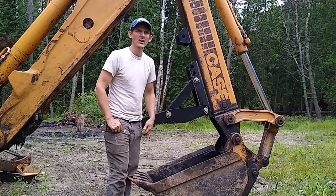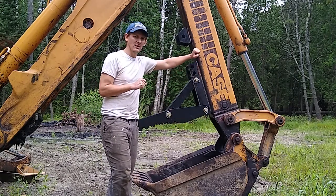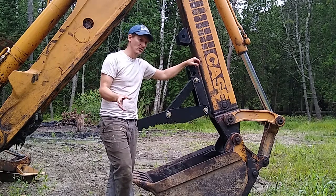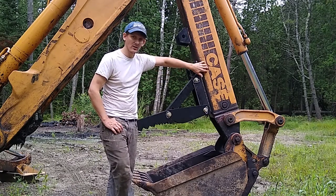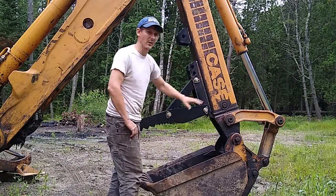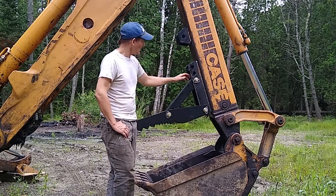When you're placing this thing you really want to push it as far down to this weld as possible. This is an extenda hoe, which is super important, because non-extended hoes generally have ductile iron and require special welding techniques and materials. This extenda hoe is regular mild steel — as you can see it's already welded on this seam here and on the bottom — so I didn't feel bad about welding onto it at all.